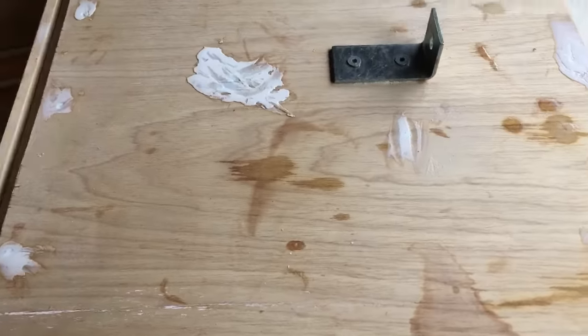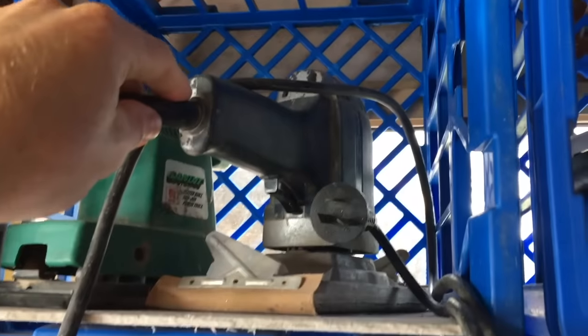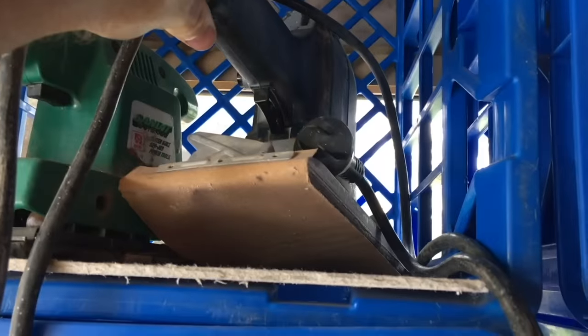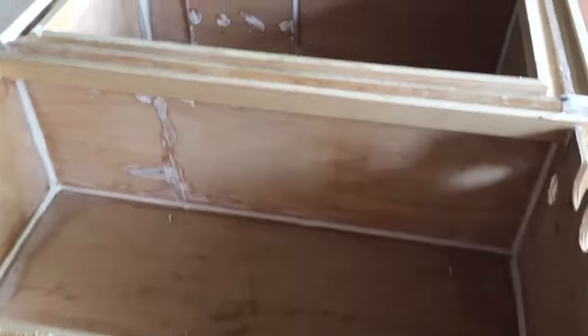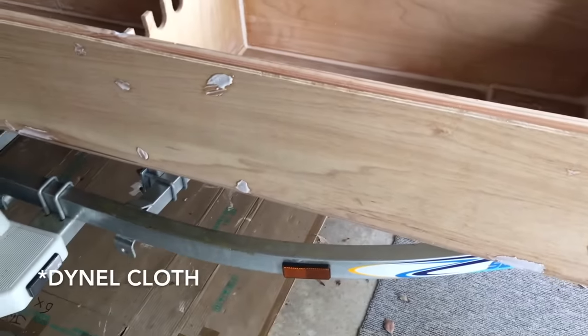Bunch of epoxying this morning. Did all the screw holes at the front. I think maybe one or two more goes at epoxy just to get the gaps all done on the top and the sides. And then once that's done, then it's straight into the sanding. Mum's got one of these bad boys. So I'll probably put some 80 grit sandpaper on there and go over all of it just to remove all the heads off it. You don't have to go too smooth on the bottom because that's going to have fiberglass over the top of it.